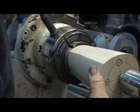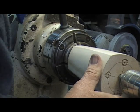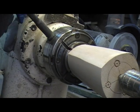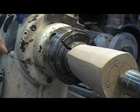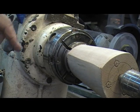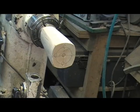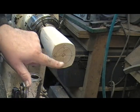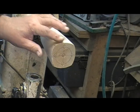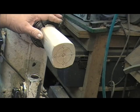I brought the tailstock up to make sure I'm running through the center before I tighten it up too much. Then we snug it — roll it over, snug it again. My daddy told me that's why they got more than one hole in that chuck. Now we're ready. We have put it in the chuck and brought up the tailstock to center it. I want to hollow this thing somewhat to make a jar out of it — that's what we're going to start on.